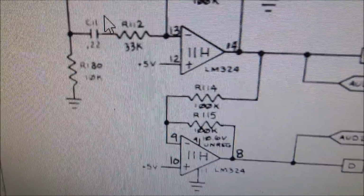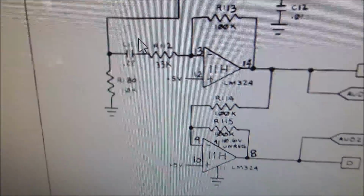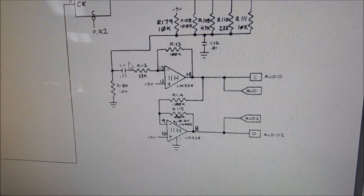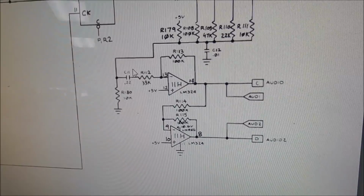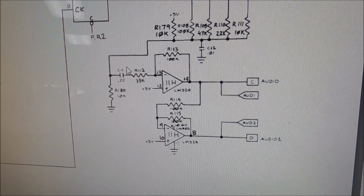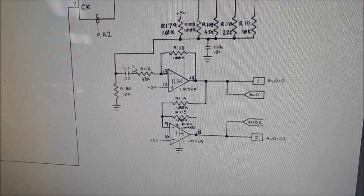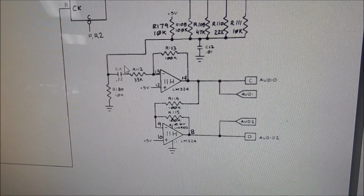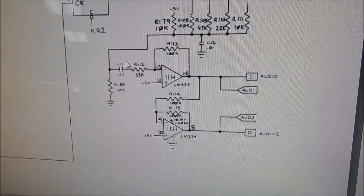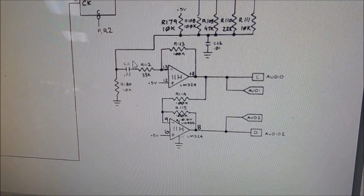But all of the audio runs through this one chip that is a preamp. So if I was just going to have to throw a dart at a dartboard, I would think it's that chip. So I'm going to test the rest of the voltages in the bottom just to make sure. And if they're all fine, I'm going to replace that chip. But like we just saw on the schematics of the amplifier, it only runs off 10 volts, and we know we've got that. And then this just runs off 5 volts, and we know we've got that. So what missing voltage are we looking for here?